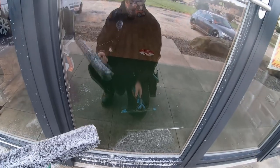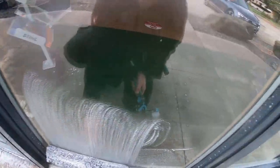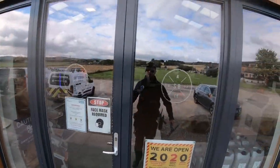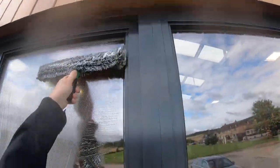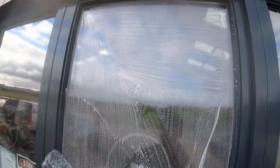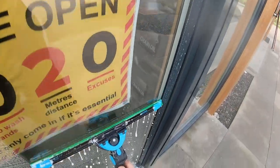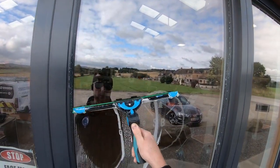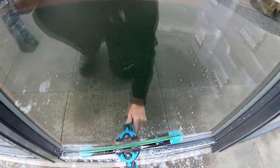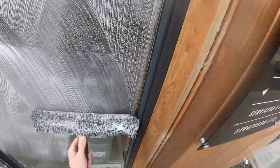See now — cleaning this and I can see after I've cleaned it, there's a scratch, nothing I can do. But here there are spider droppings still there so I can give it another scrub and then squeegee it again, and now I know it's 100% clean. I'm going to try that other technique again: cut in, come all the way down, back up over the top, down, then there's our solution, come around and cut straight down at an angle so the water runs up the squeegee and not towards our clean glass. Just rewind the video on that technique and practice it yourself — it takes a little bit of practice to get it right.